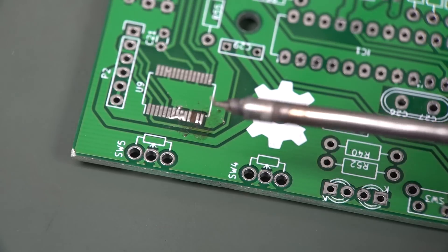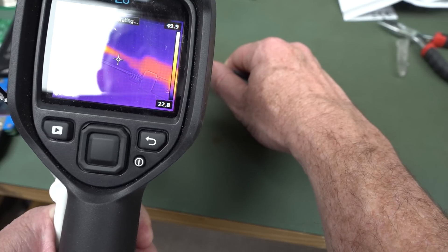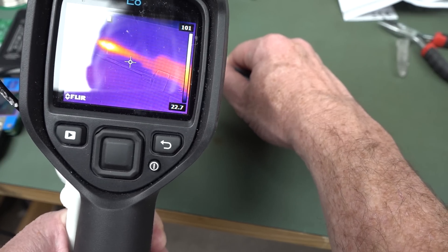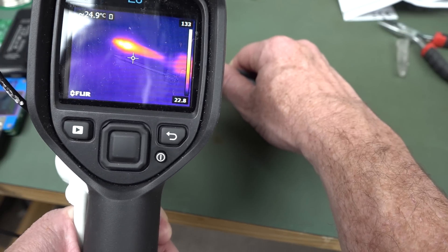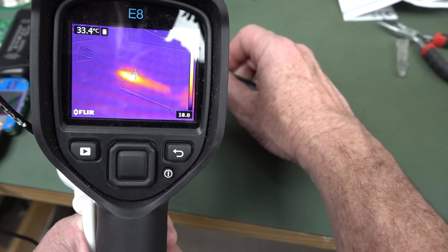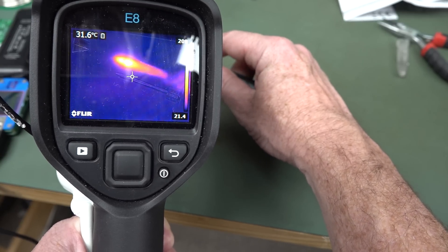It's mostly contained within the tip. It's not registering the correct heat because of the reflective, polished nature of the tip — I haven't got the emissivity set. I rather like that thermal profile — it really contains it. You can see where the heating element is, right down near the tip, and it just doesn't propagate back down the barrel. Nice.